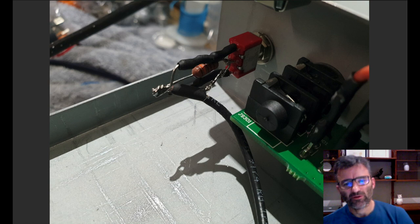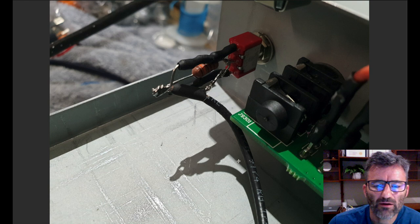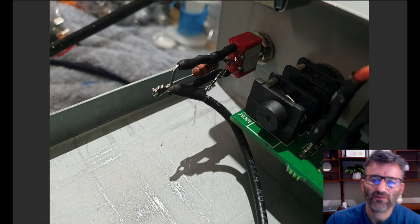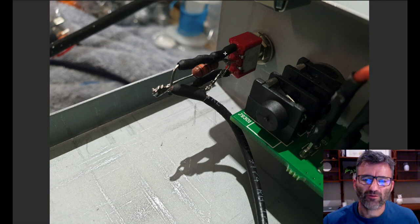This is how I set up the Zener diode switch. So in reference to the schematic, here's our 220K. It's to the middle pin of a three-way switch. It's on, off, on. Underneath this heat shrink here are two Zener diodes back to back. One of these is a 20 and a 20, and the other one is a 24 and a 5, and I just terminate them here together.